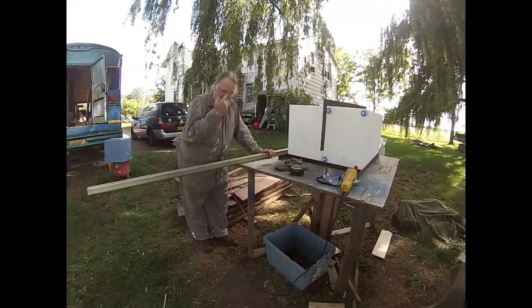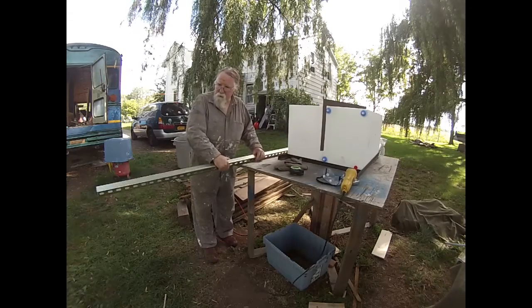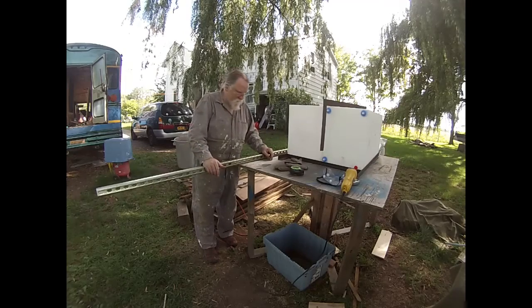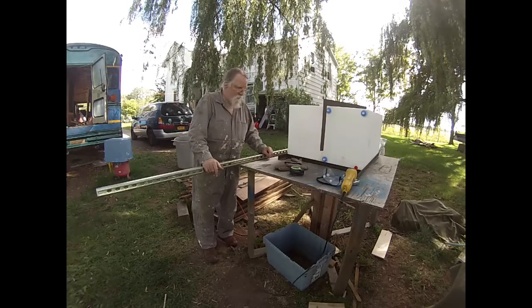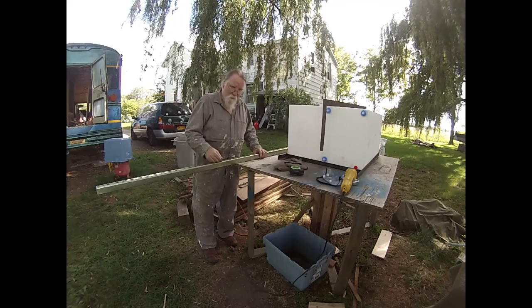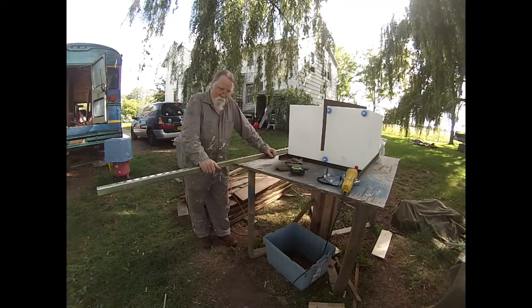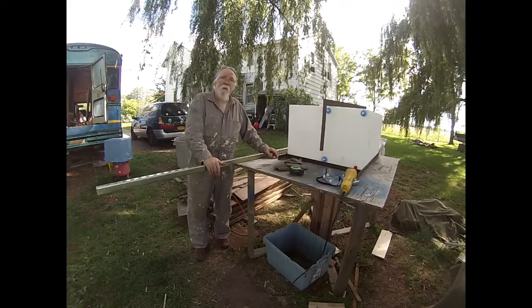When I said I was going to bolt it up through the floor, that was one of the plans. The other one is to put this across the top of the frame. I got to cut it long enough to make it short enough to be able to fit it up in there. So I put it this way, bolt up through, same thing, the rods with a nut and a washer, and tack weld the nut on so it can't back off, and then hang this up there, and then hang all this off of this.